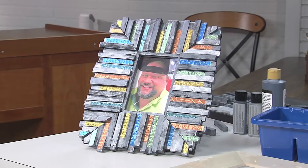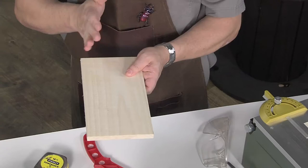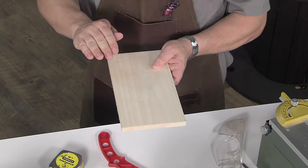I wanted my pieces all the way around that frame to be a half inch wide, but different heights. So I have some scrap lumber that's a half inch thick, and if I rip cut it with the grain into strips, then I can flip it — it'll all be a half inch and give me different heights.